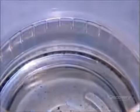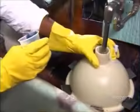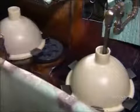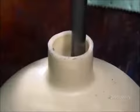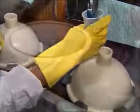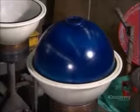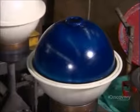It's made of colorant, plasticizer, a chemical called ISO, and urethane. Blending these ingredients produces high-performance polyurethane. As the mix flows into the molds, a chemical reaction causes it to heat up and solidify in just seconds. Then it's into an oven to boost the chemical reaction.